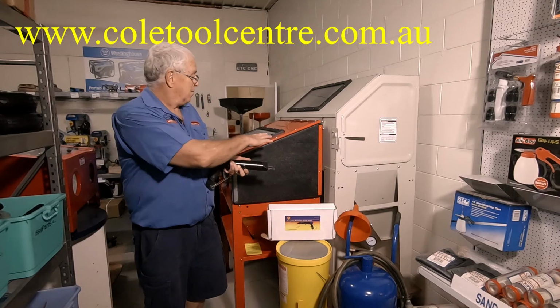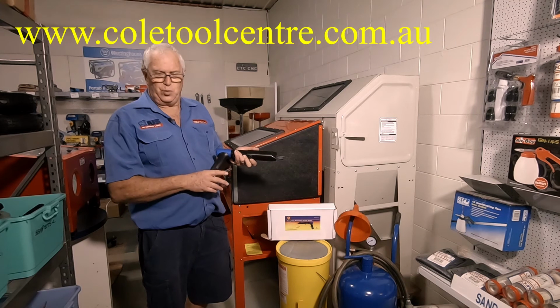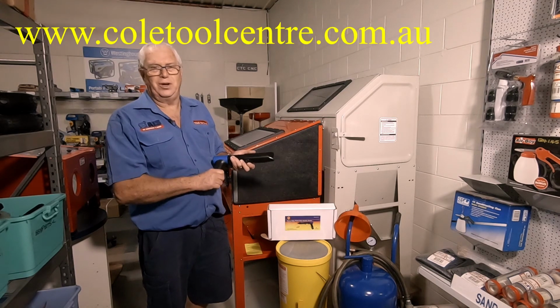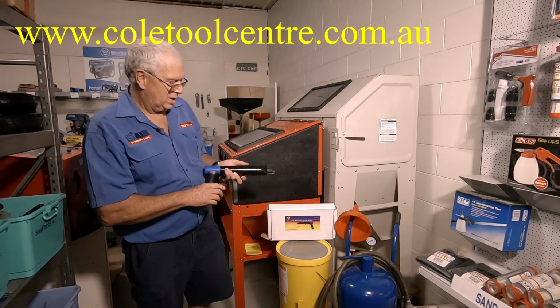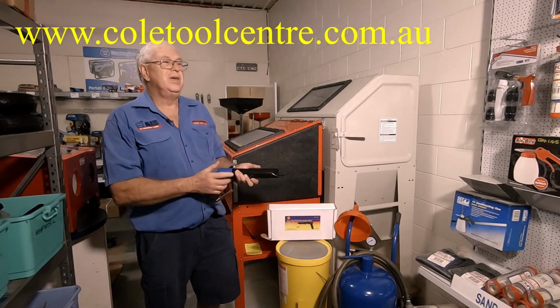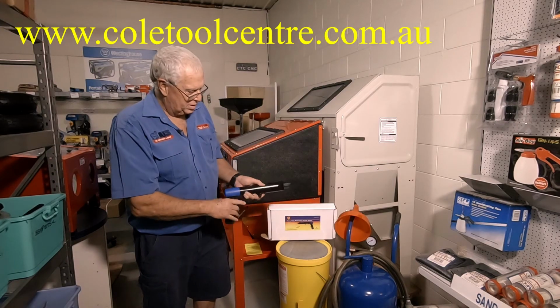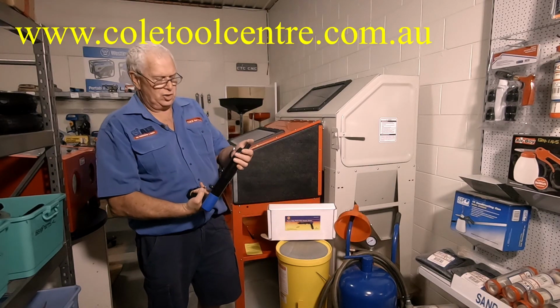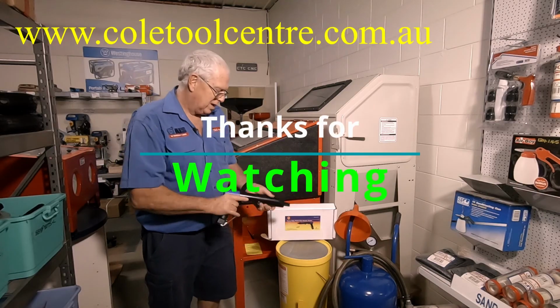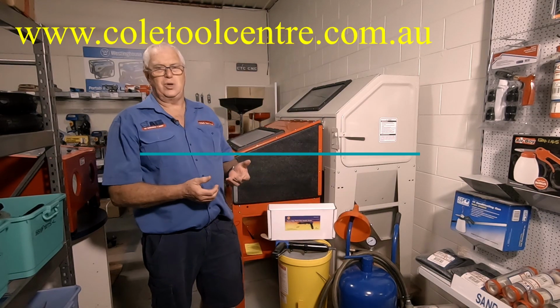And if you then come along with a sandblaster, you'll get a lot more done without having to worry about the quantity of air that you're going to have to use because you haven't got a big enough compressor. So these are a good way to go, and then finish into corners, because these will go right into corners and flats, and they just needle scale and chip all the rust and paint away, and give you a very good surface to actually paint over again.